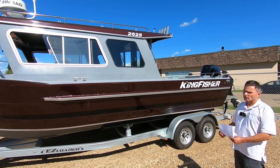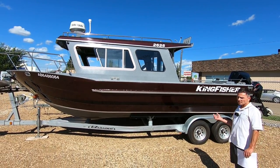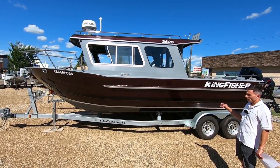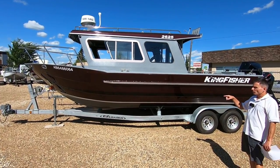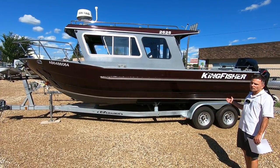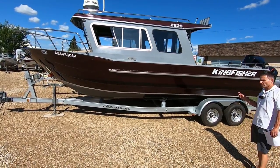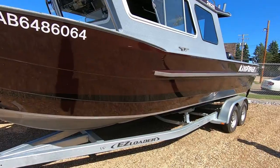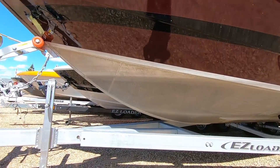The 2625 measures 26 feet 4 inches. Because it's the CXP version with the pilot house forward-facing cabin, this boat is measured from the back of the engine bracket to the bow of the boat. So this is inevitably the same length as the 2425 Experience, which is measured without the engine bracket. The sides of the boat have 1/8-inch (0.125) aluminum on the sides and the standard bottom is 3/16ths. This particular boat has an upgraded hull bottom of quarter-inch.